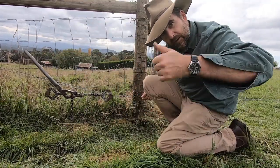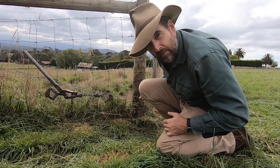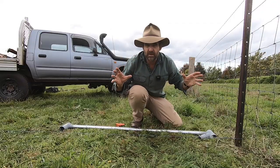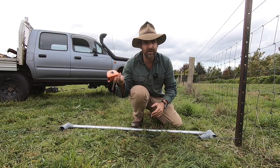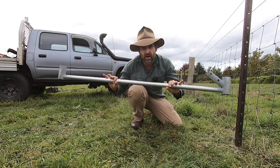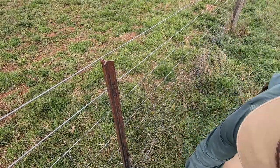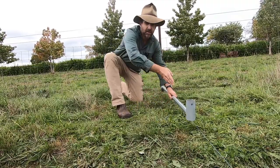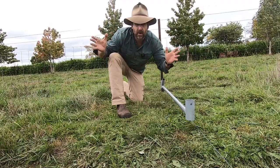That's reasonably tight. We're going to go up and give it a bit of a twang — make sure it's lying flat on the ground — then we can start marking out where we put our posts. Now we need to start measuring up to put in the new end assembly. All I have to do is use the top brace to mark out where our posts go. Line up my top brace with my ground wire and my whole fence end assembly is measured and ready to go.